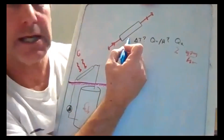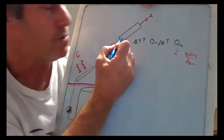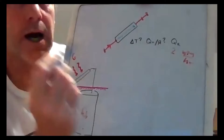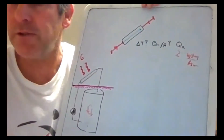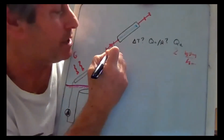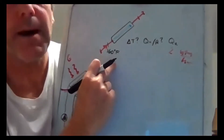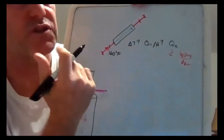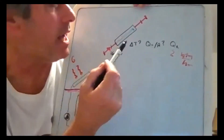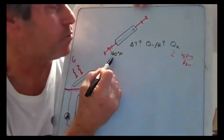Method one: a simple collector — just a tube, and the water goes through that tube. I went outside last week and showed you one. That's going to work pretty well, but how is it going to work when the water gets really hot? We have systems where we'd like the water to get up to 160 degrees Fahrenheit in the afternoon. For sure we want over 100. With just black tubing connected to fins, there are going to be problems when it gets warmer.